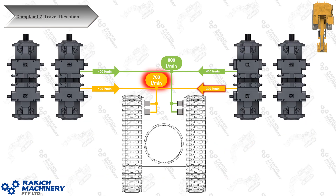One of the more common complaints with these machines is travel deviation — it's not able to walk straight when the operator gives it full pedal actuation. On the older machines where main pumps three, four, five, and six are responsible for travel: main pumps four and six both putting out 400 litres a minute sends 800 litres to your left-hand travel motors. With poor pump calibration, main pump three might only put out 300 litres a minute, sending just 700 litres to the right. That will absolutely make your machine deviate while travelling — a big problem when operators are trying to work along a bench and keep a straight face to mine. Poor pump calibration is almost always the cause of this in my experience.